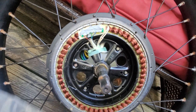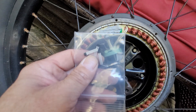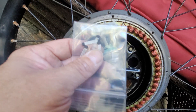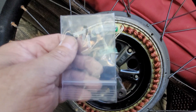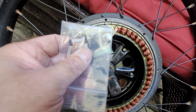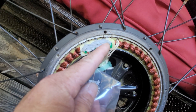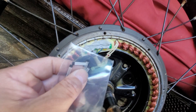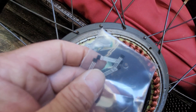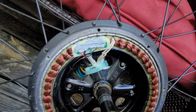When you're replacing these hall sensors it's as easy as that if you know the correct hall sensors to use. I'll post the link to these hall sensors in the description — these can be used in just about any motor. I use them in all of them and they work great. These were recommended by Grin Technologies and I've been using them ever since. It's as simple as removing the hall sensors from the circuit board — you have to solder them in obviously. Sometimes when they don't have that little board, the wires just go directly to those legs. You can see how small they are, so you have to isolate those with some heat shrink wrap. It's a tedious job but it can be done.